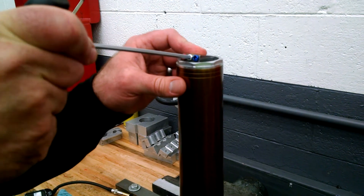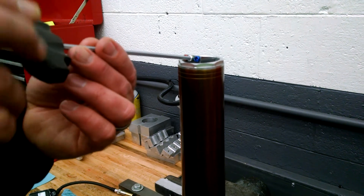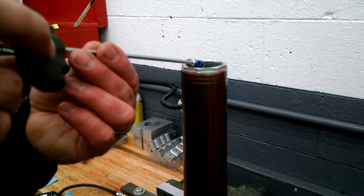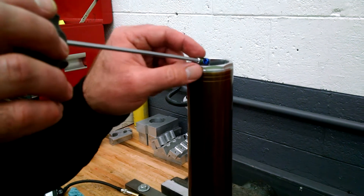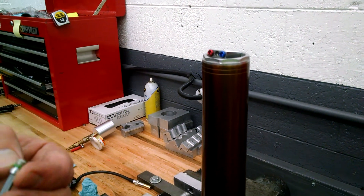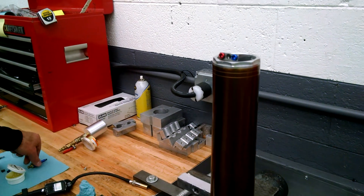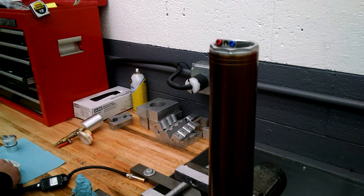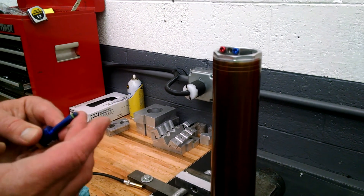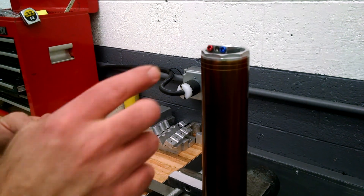Setting the mid pressure region is basically a repeat of setting the high pressure region, other than utilizing a different pressure. Get in the habit of turning these out slowly — when you turn them out fast it tends to pull the O-ring up against the thread and it'll get torn. If the O-ring gets torn, your fail safe has been reduced and you could develop a leak.